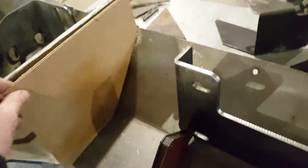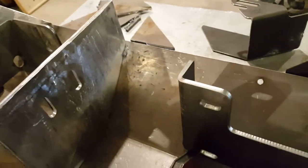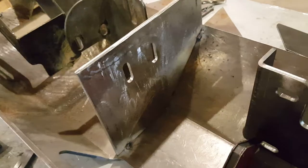I start out with what I call old-school CAD — I just start with chunks of cardboard, do my measurements of angles and lengths and stuff to get my plates and everything fitted in there, then copy it down to the steel.